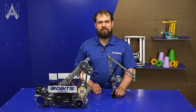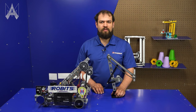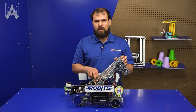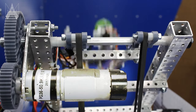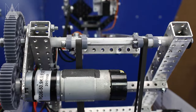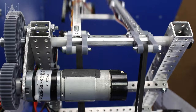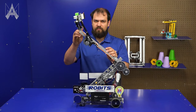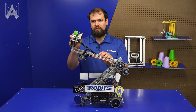There are a couple of different decisions you need to make when designing an arm. One of the most fundamental decisions is what style of arm you want. One of the ways to decide which style to use is to look at your design requirements. This style is one of the most basic — you've got a motor here with a gear pair and a live axle. The live axle means that when the gear rotates, the axle the arm is on also rotates. Everything after the live axle is fixed, and if you want the end effector to move, you need a different mechanism powered by this servo here.